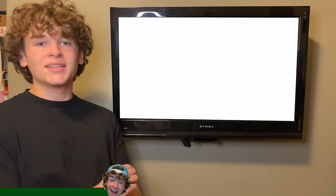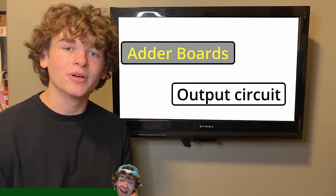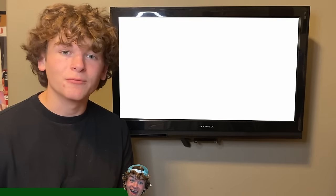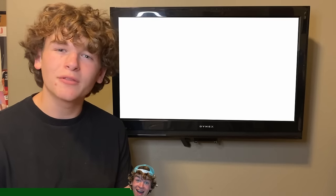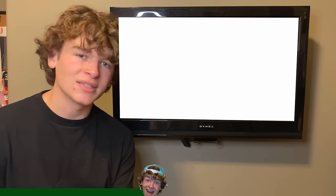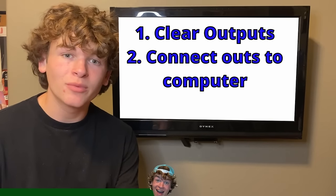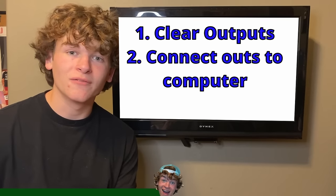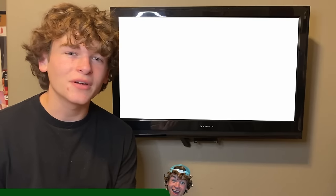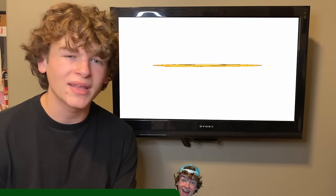The same thing happens with the output — except instead of us pressing a button to turn on an output, the computer tells that output to turn on after we press the calculate button. There are situations where outputs need to be cleared, so what we do is have the calculate button activate a process in steps: first clear the outputs, then connect the output boards to the rest of the computer to load in the output information, then disconnect it so we can put in different inputs. This is difficult because it all has to happen in sequence with one button press.